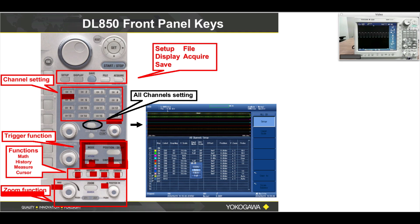There's one very special button. If you experience fatigue from navigating multiple layers of soft menus, the DL850 offers a spreadsheet-type approach. You can sit at your desk and set up each block in a spreadsheet view using this button, with a USB keyboard and mouse for point-and-click parameter entry. You can also quickly copy a channel to another channel — if you have six channels to set up the same way, you can copy and paste just like an Excel spreadsheet.